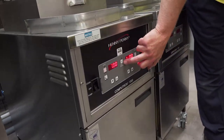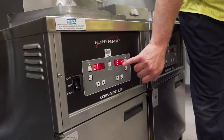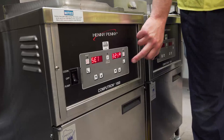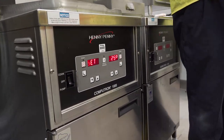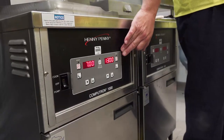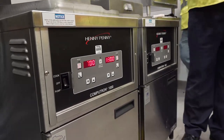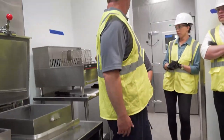The P button is program. If you press it once, it'll display your current temperature. Press it again, it'll tell you your set point — 325. You don't want to adjust that ever. If food safety checks show your products aren't coming up to temp, adjust your time instead. Always run 325 for the products.